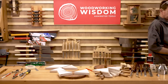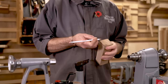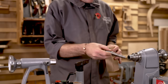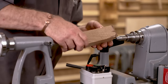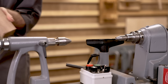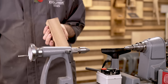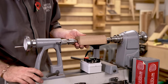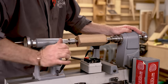We've got our blank. So our centre bit for the handle, we've got a piece of elm, 2-inch square, could be a little bit smaller. I can reduce the diameter. I'm just finding my centre. Nice and quick. Our pencil, we're going to go ring drive in the drive centre. Revolving ring centre, tailstock. I can, if I find my compass or point there, let's just pinpoint these. A bradawl would be good, but I've got my dividers there. Bring this up, lock up the tailstock first so we're not pushing this up, and then we wind the handle a little bit off there, that's good. Knock that up.